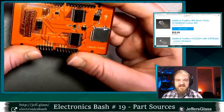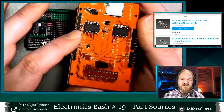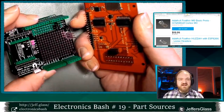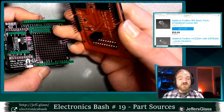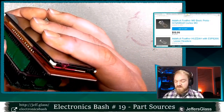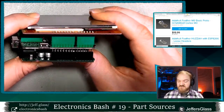And whatever pins I would need to control this LCD display, which is going to be quite a bunch, LCD D0, D1, D2, D3. If you remember back to our LCD displays week, we needed like 7 control lines for them, and they're hardwired on here. But I could pick the control lines that I needed for the XB shield to be different from the LCD shield. So I would need to be cautious about it and figure out which pins each one was going to use. But then in theory, I could just use them both. And assuming I had the space in my Arduino for all of the various libraries I might need to talk to these things, there's no reason in general that you can't stack shields and continue to use them together.